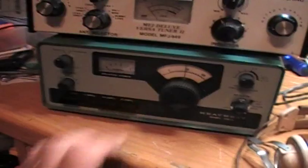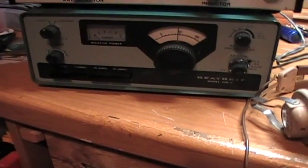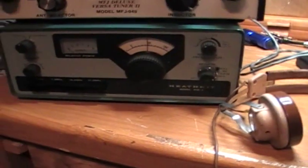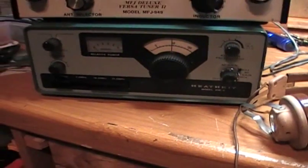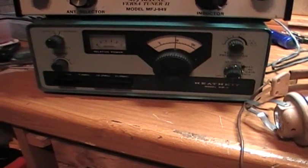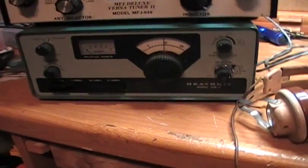That's just to give you a sampling of it. I'm running about a 20-foot piece of wire — that's all I have for an antenna, and it's about six feet off the ground. I live in Texas and I'm pulling stations in from the Midwest, up around Minnesota and Michigan. Nothing on the East Coast with my little wire, but pretty good.